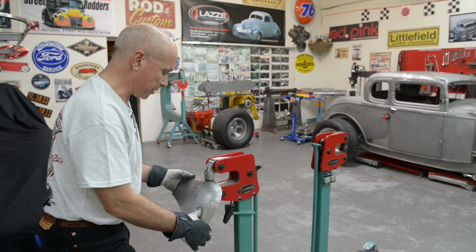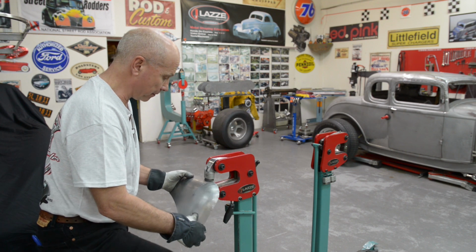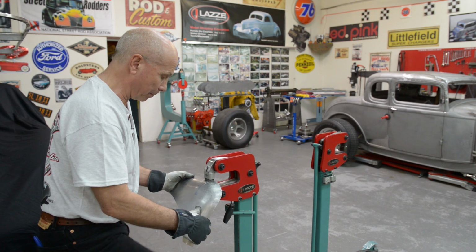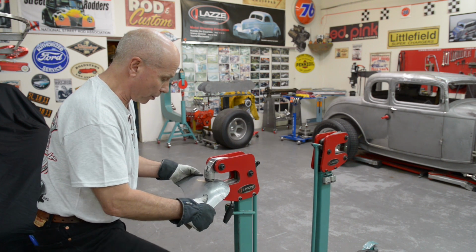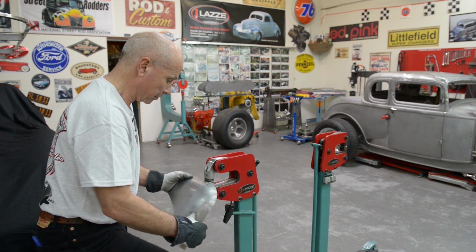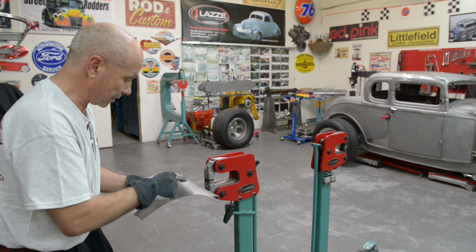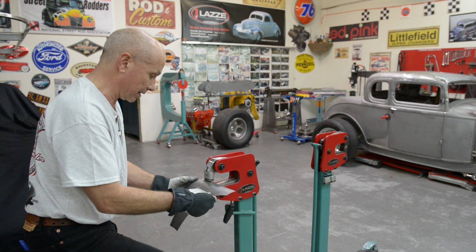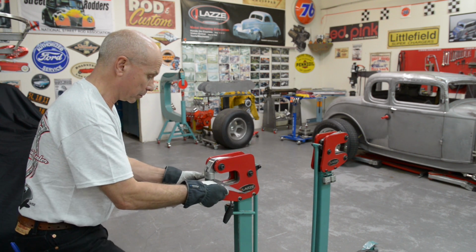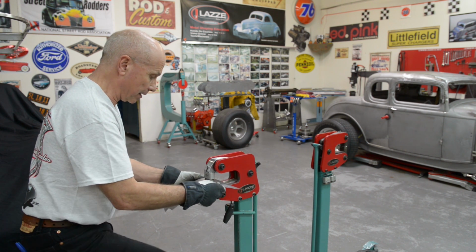So I don't shrink much on the edge, I'm shrinking a little further in to see if I can get rid of the high spot there. And I go a little over the bubble there, but I have very little pressure there. And then I go a little more pressure there. See if this one feels much better now. So let's do this part here. It's not so much on this side. I'll move it over there a little bit and blend it in.